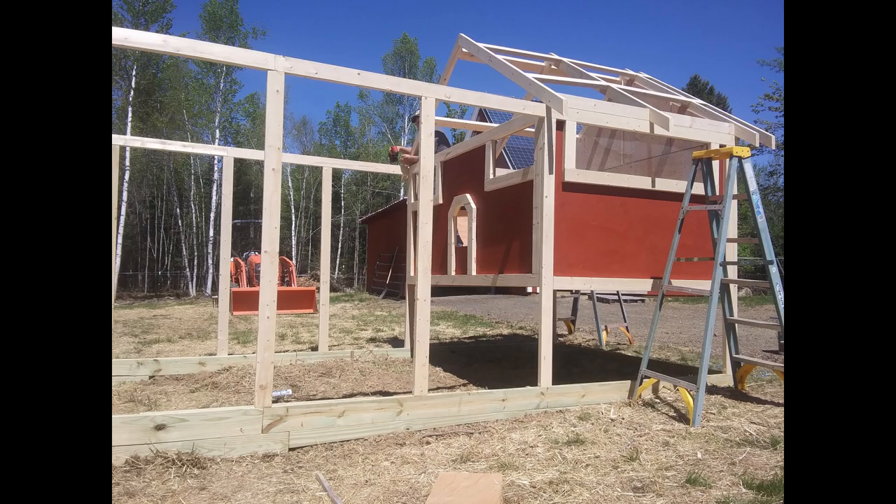That's a close-up shot of putting a screw in. The one 2x4 in the picture just above the window looks like it's at a funny angle because I haven't screwed it in yet — gravity's pulling it down a little bit, and that gave me something to push the rafter up against and hold it in place.